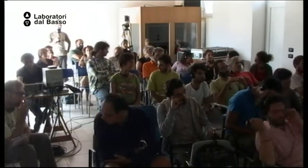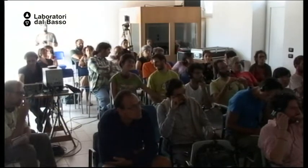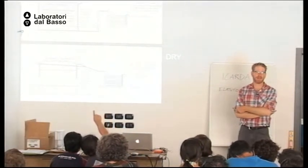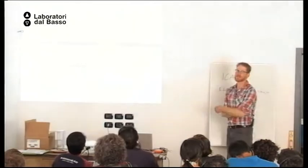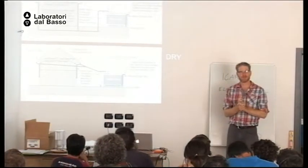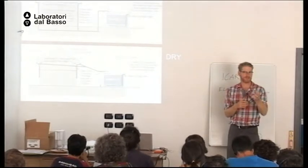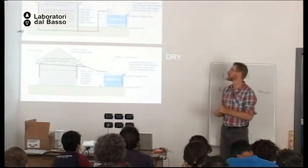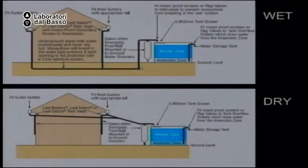Yeah. So there are calculations, but I have found they're not very good. The main thing you need to keep in mind is if you size your gutter and downspout to the size that your building code says is correct for your rainfall, you should be fine as long as you minimize the number of bends. Because for every bend, you're increasing surface friction. And if you have a lot of bends, you want to go up a size in pipe. Yeah, the length also will increase.